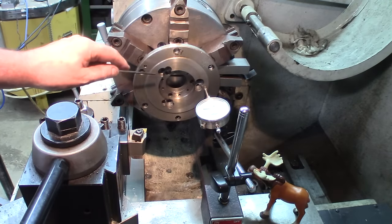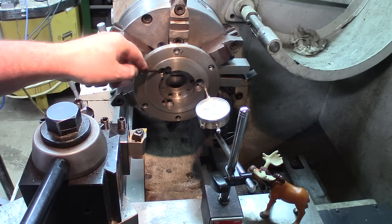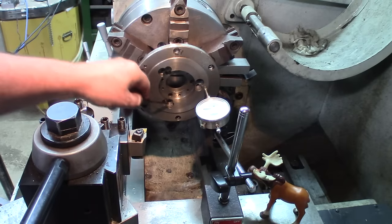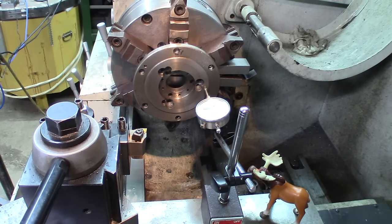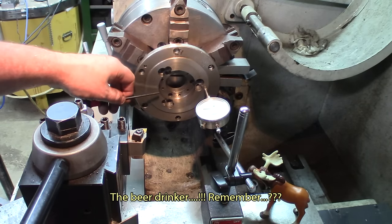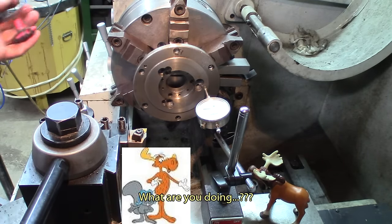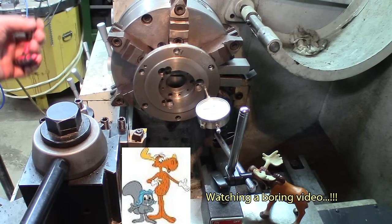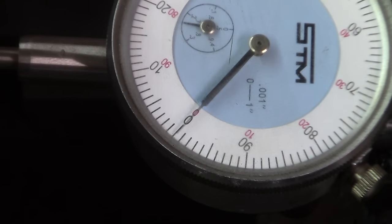As we can see, this is the back of the chuck — a normal chuck meant to be mounted with the D14 studs in the holes, with retaining screws and D-pins to prevent unscrewing. The previous owner bored this out of concentricity by fifteen thousandths of an inch total runout. That has to be addressed because a tool with that much runout is unacceptable. This is a one-thousandth-per-division dial indicator.